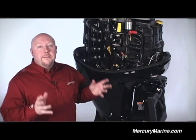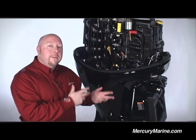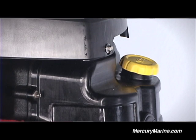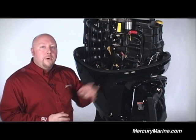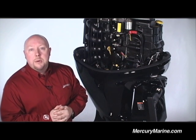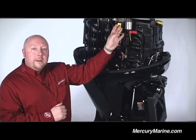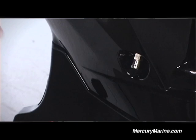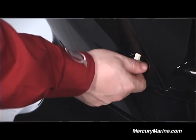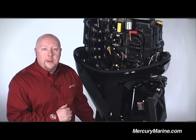One of the things you're going to see on this side of the engine is a lot of yellow. We color-coded all the major maintenance points on this engine with yellow to make them easy to identify quickly. Starting with the oil fill cap right up here on the front of the engine — if you keep your boat in the water, you can not only fill the oil there but drain it with an optional pump-out kit. If you keep your boat on the trailer, it's also an easy access point to fill the oil sump when changing oil. In addition, there's an easy drain point down here where you can connect a hose before opening the valve to drain the oil, preventing oil from running down the side of the engine and creating a mess.